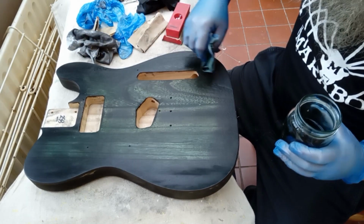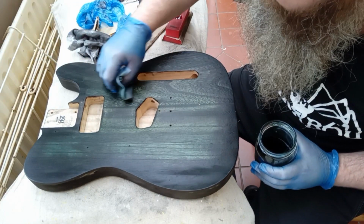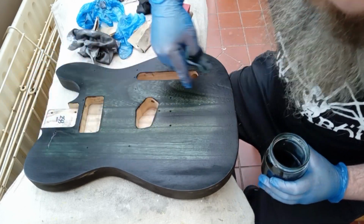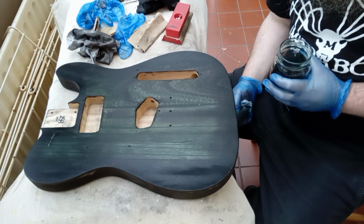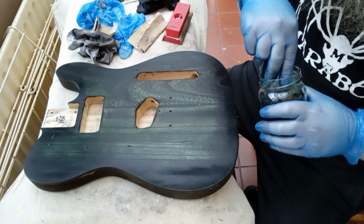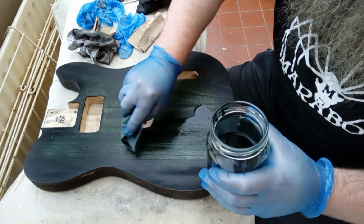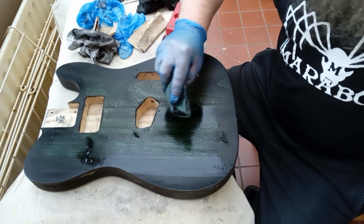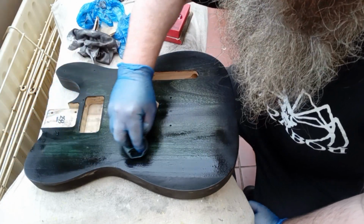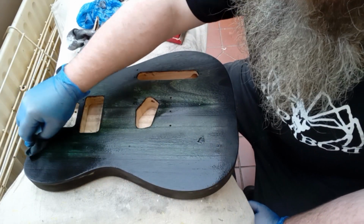This one will take a lot longer to dry because it's got less wood underneath it, essentially, because we've got the original black layer. It'll dry quicker here, obviously. That's not looking too horrible, is it? You see the original colours compared to it. Let's do another pass. Oh, we've got drips. Drips are not good. We'll use it to our advantage, and we will saturate and then mop it off, just so we can pull it through all the grains.